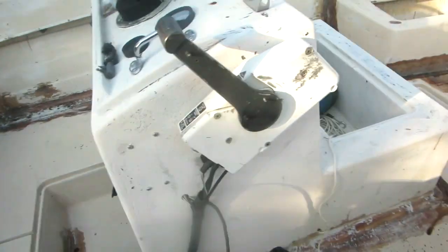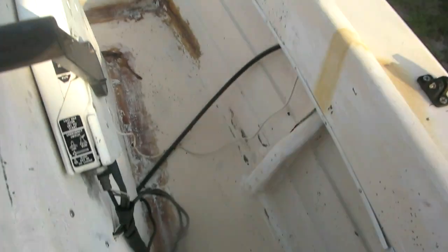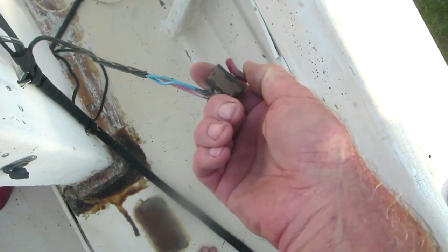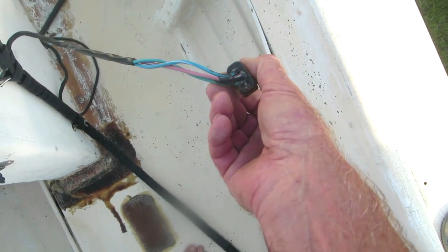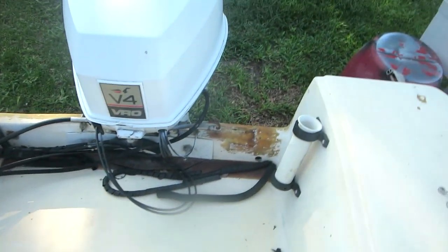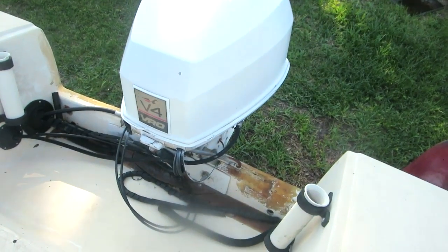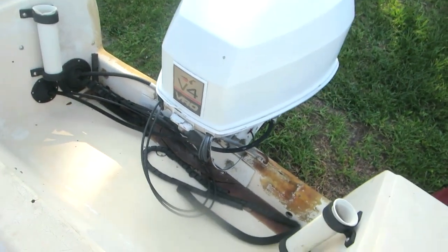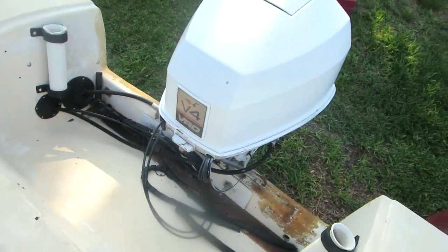You can tell it's down — there's a nice glorious yellow color now. My trim and tilt is not working. There's a switch; I think there's a problem in the switch. I'm gonna find out — turn the power on, see if I can get the trim to run up and down, bypassing that switch.